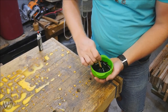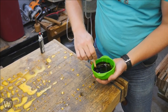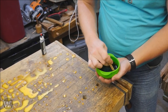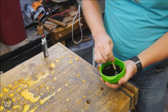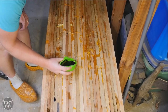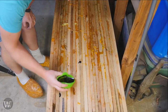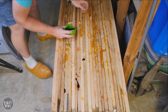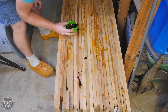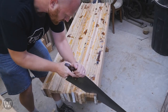So I'm going to mix up some epoxy with some trans-tint dye to fill some of the gaps. A lot of people are going to be asking about all this glue on my benchtop — that's not a problem. There is so much paste wax on this thing that glue just pops right off. So I let it dry out and then clean it off. But this epoxy I'm going to be using to fill all of the voids and cracks and any knots that may be showing in the top of this bench — basically just trying to give it a little bit more of a smooth top. And then I can plane off that with all of the glue that I have to come off.